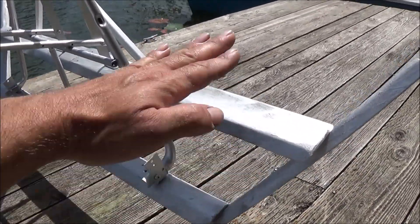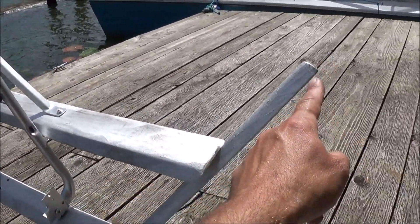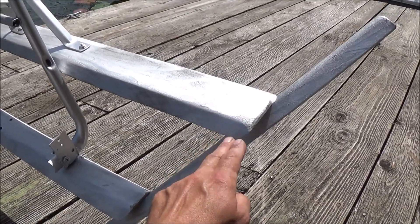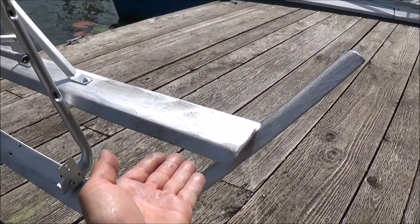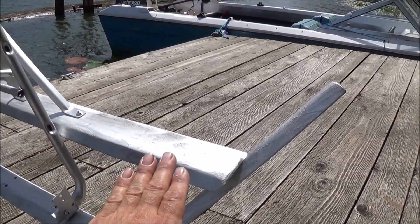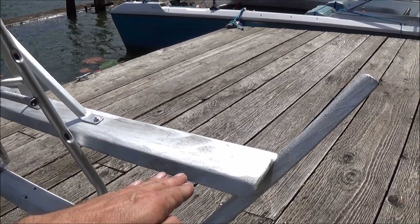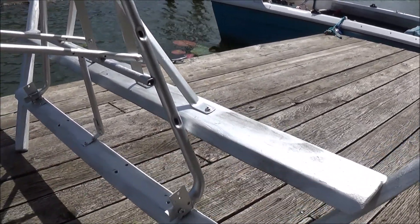These flat foils are really bad for that. The only way you can keep these flat foils from smacking your whole boat back down against the water once they break the surface is by adding these surface-piercing side foils right here. All they're doing is adding side pressure against the water in the gaps between the foils and the bottom of the boat — so it's not an air gap or vacancy zone. That'll help reduce the speed at which it settles back down, keeping the foil angle from going downward and diving the hull into the surface.